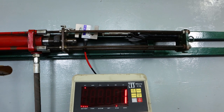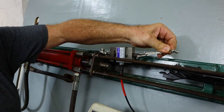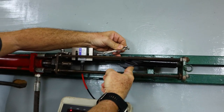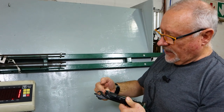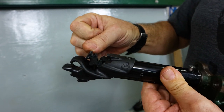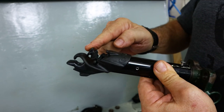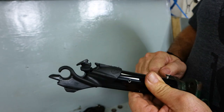There we go — it did break out, but as you can see, that held well over 200 kg. You're never going to be able to pull that hard. As I mentioned before, this was already a stressed muzzle — it had broken out there and that whole front broke out. Still very, very strong even though it was already a stressed muzzle. This is 30% glass-filled nylon — super strong, but it will still break.